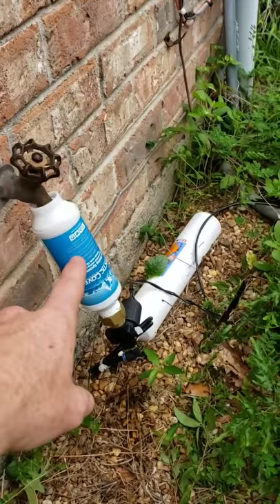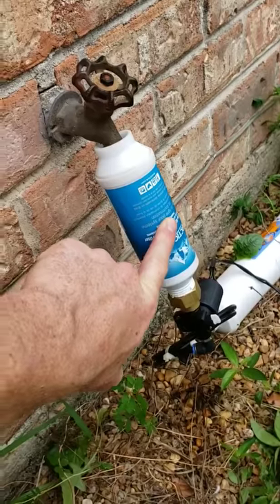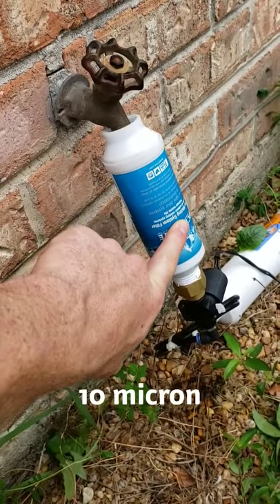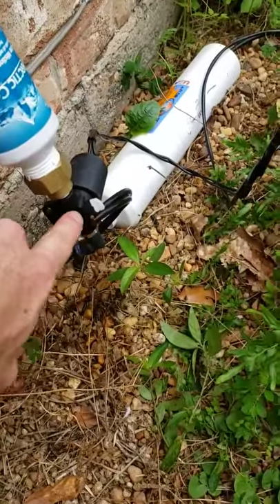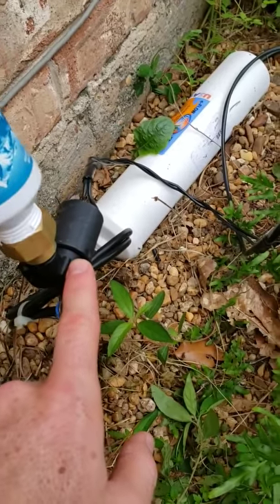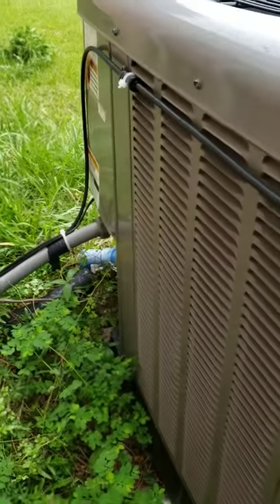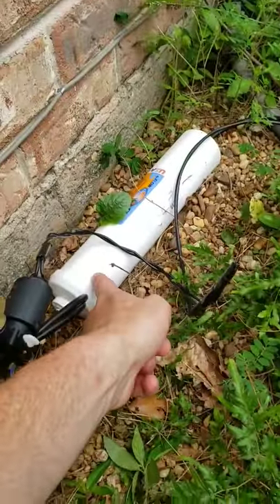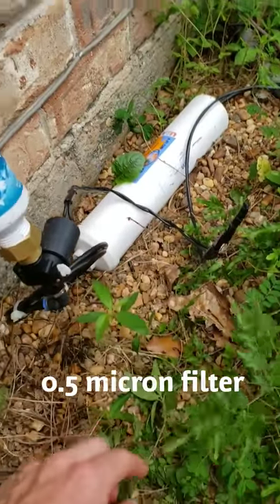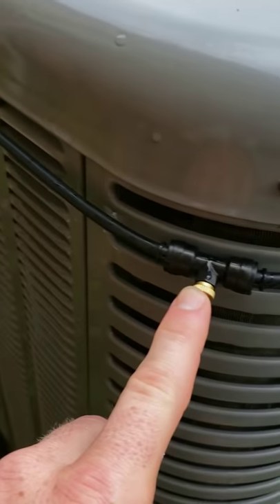The setup is a calcium filter here with a rating of 10. Then I've got this solenoid switch — it has an on/off switch so I can leave it on all the time, or the solenoid will trigger whenever the 24 volts is contacting. The unit cut off and the sprayer cut off. It goes down to a 0.05-rating filter which filters everything — any type of sediment.